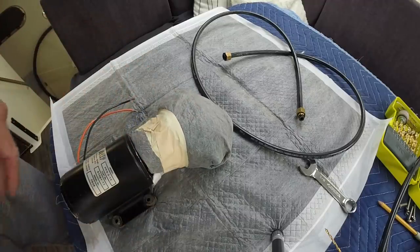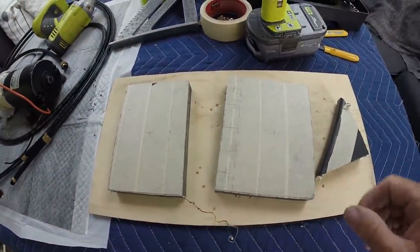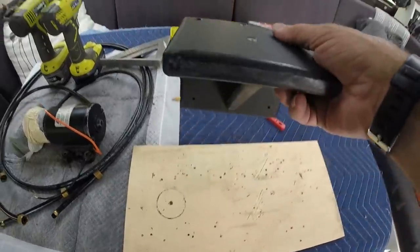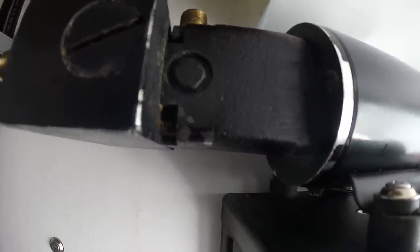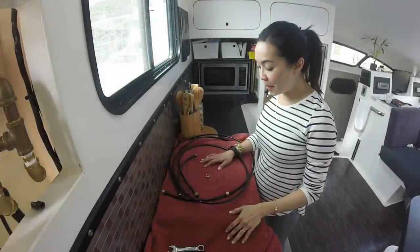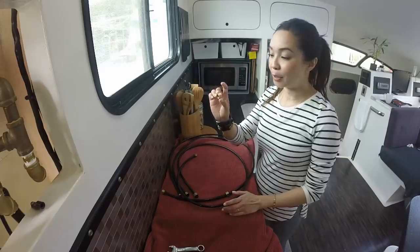I just put a little diaper on the pump while I get it installed so I don't make a mess. Since this pump has to be mounted horizontally and I want to put it on a vertical wall, I'm going to build a quick mounting bracket out of starboard lumber. And there we go — now I can mount this to the wall. The pump for the autopilot is installed. Now I can take hard measurements up to the Capilano and have new hydraulic lines made. We just got back from the hydraulic place — great news, they inspected our lines and they're in really good shape, so we're able to reuse them. We'll cut them down and use new fittings.